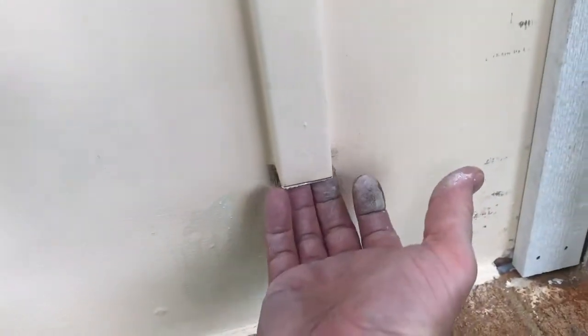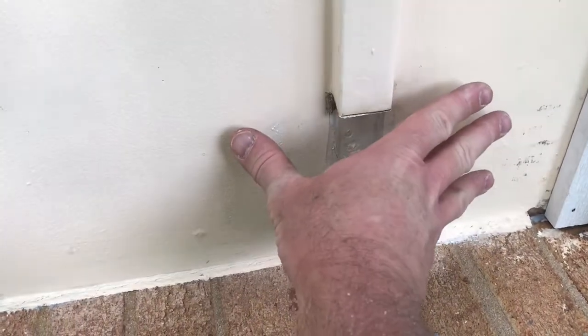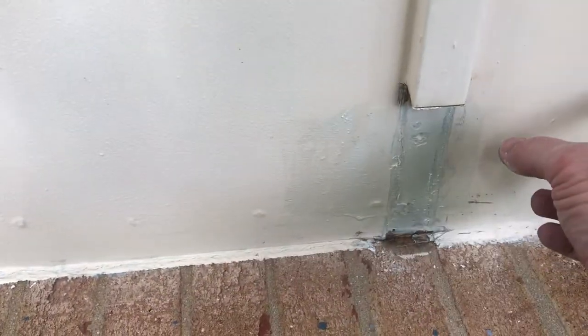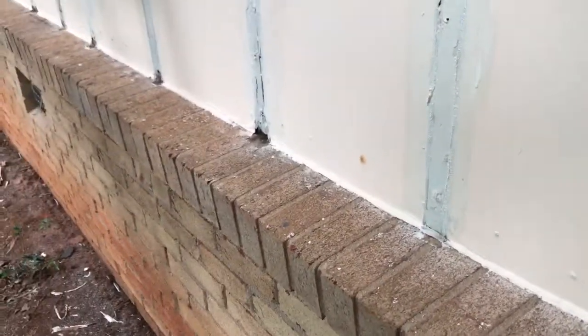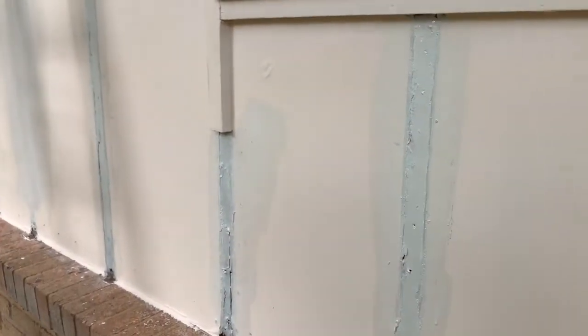This one I kept on here, and we've cut a 15-degree angle on it. This board is going to slide right underneath here — we're going to attach it with some liquid nails and then use our brad gun to nail in at the top. We're going to install this piece, then put all our uprights in place, caulk everything up, and call this project done.